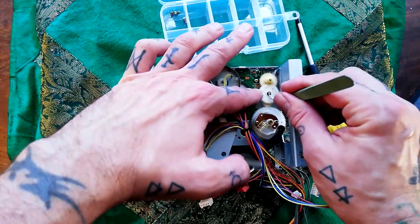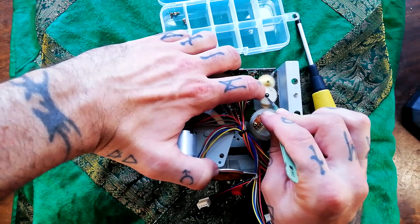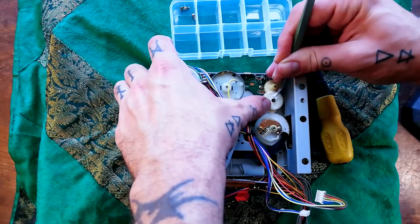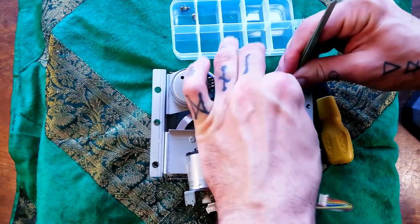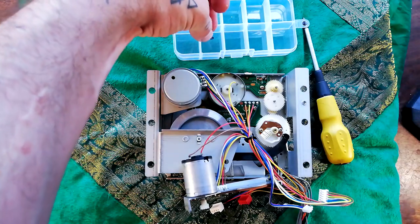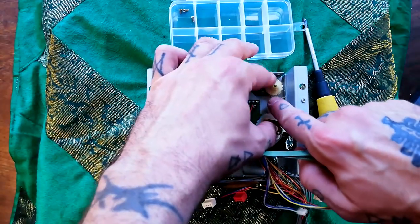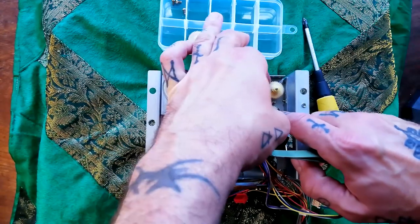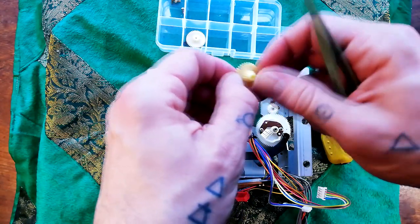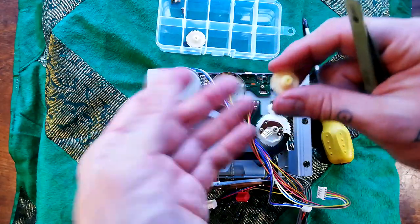Scraping some of this lubricant off so I can try and see the split in it. It's not difficult, but it's a pain in the arse — you're probably going to make half a dozen attempts at getting this off before it actually comes. There we go. That's a danger of flipping away, so I've tried to put my fingers over it — make sure it doesn't go anywhere. You must keep that safe; I haven't actually found a replacement supplier for those. At that point, that will lift off. The grease on there can be pretty stiff — it becomes a kind of gluey consistency. Sometimes you'll find these are intact, but then if you apply quite gentle pressure, they'll snap in your hands. You can feel it's got more give than you'd want a mechanical part to have, but it is okay.